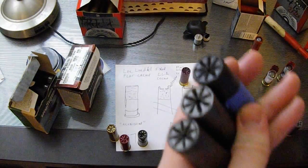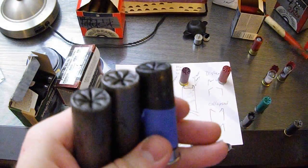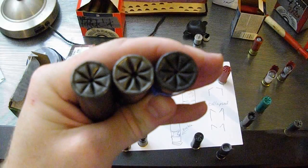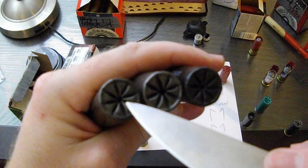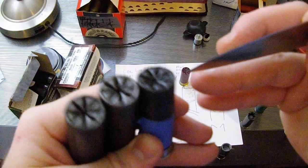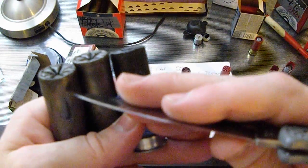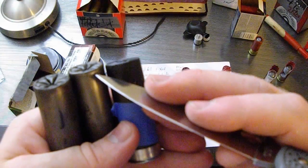These were made on a Lee press before I did the mod. We've got three of them here. The middle one is open in the middle. The one on the left is very slightly open, but not big enough for the pellet. The one on the right is also very slightly open, but I wouldn't be worried about that. You can see a wear band right there that should have been the very top rim. That means the wad column should have been set a 32nd to a 16th lower — my video on modding the Lee press gives you a way to control that more precisely.